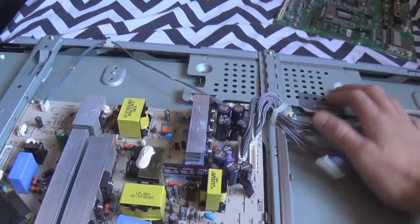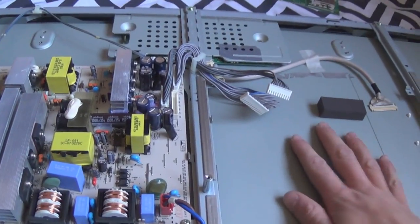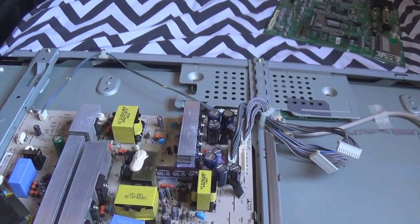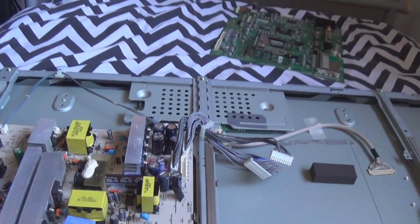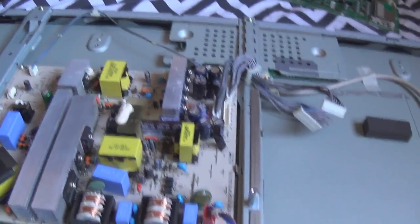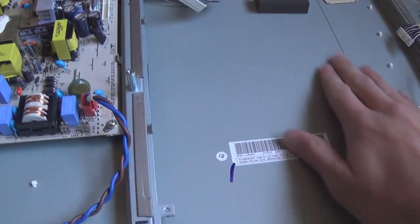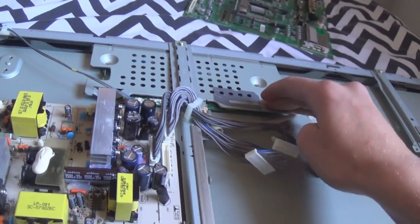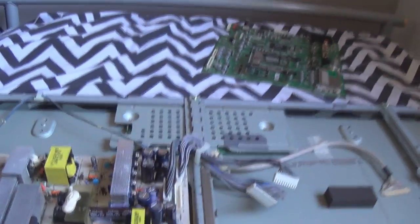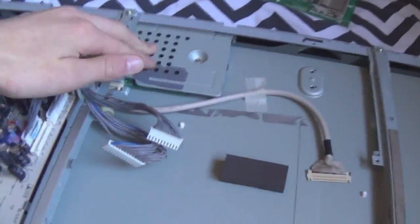Anyway, the reason why I don't think it's an LCD fault is because when the LCD glass was flickering, the backlight was as well, until I turned the backlight dimming feature off, and then the LCD was still doing it, but the backlight wasn't flickering. So that basically tells me that the panel, the LCD glass, is probably okay. Because if the LCD glass was at fault, the T-con, I am sure, is not that sensitive and can't pick up a failing tab bond driver like it was and tell the backlight to dim. So I'm pretty certain that it's either a T-con or a mainboard fault.